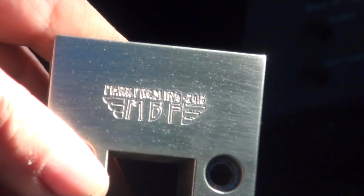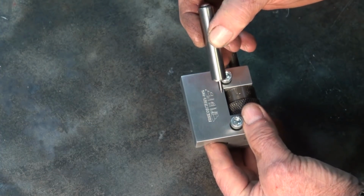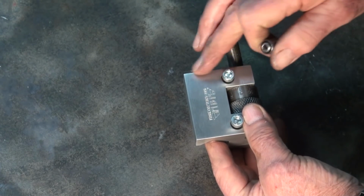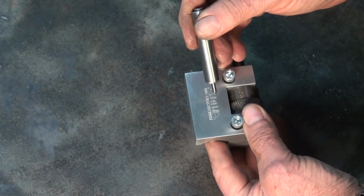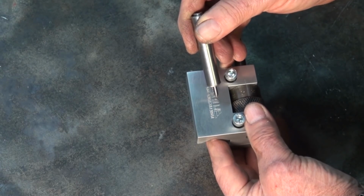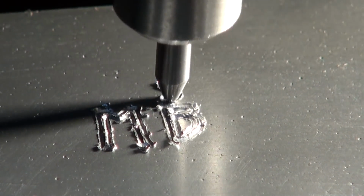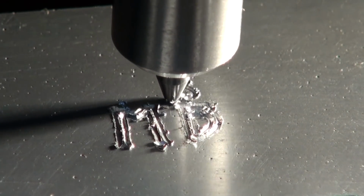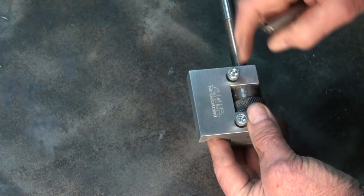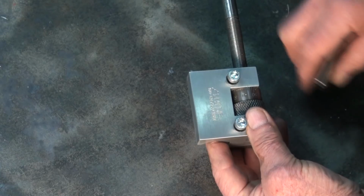The problem is that these diamond engravers work better on hard materials, so hard steel, hard brass, that sort of thing, but certainly on aluminium and this particular grade of aluminium casting, it sort of plows its way like a super tanker through the sea. Basically it just raises this massive bow wave of material as it pushes through. I don't know whether reducing the spring pressure would make a difference. Looks okay, but when you look really closely, the detail's not there.